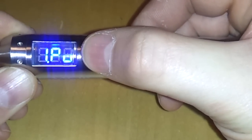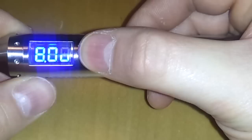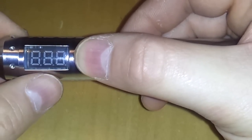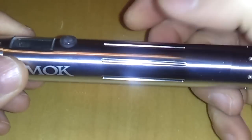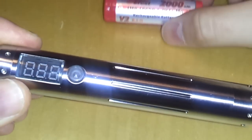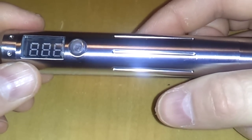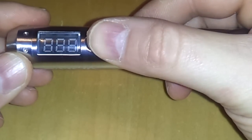Menu number 4 — clicking seven times — shows VC and reads 8.0V. That tells you how much power is in your batteries. Because there are two batteries in here it shows a combined total of 8 volts. With a single 18650 it would show roughly 3.5 to 4.2 volts. The combined voltage of both batteries is what you're working with.